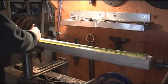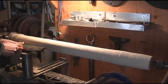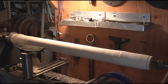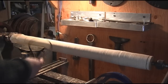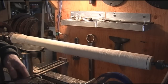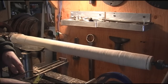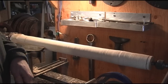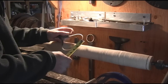And right there. So there's our... Then we want the barrel down here to be finished. It's 2 5/8. I'm going to bring it over just a hair for sanding and everything. We want the finished product to be 2 5/8. I'm going to bring it over just a hair because I'm going to sand it up a little bit, but I'm maybe an eighth over.